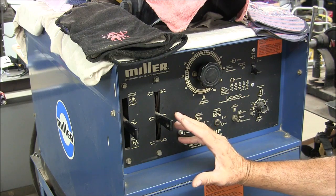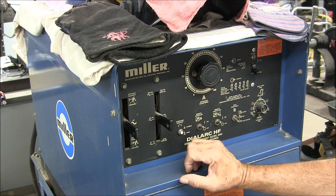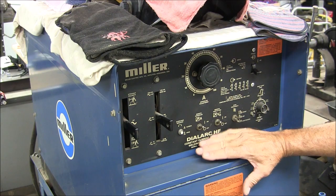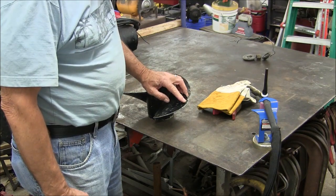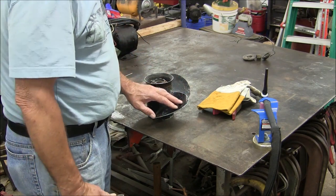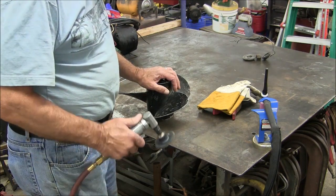There's no pulse or anything like that — if you want pulse on this, you're going to do a little tap dance with your foot on the foot pedal. That's pretty much an overview of my welder. Now that the compressor is off, let's continue to get ready to weld this prop. The first thing we'll do is clean this cracked area top and bottom, get rid of all the paint, and clean up an area over here where the ground clamp will attach.